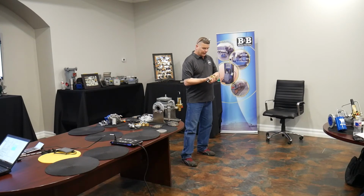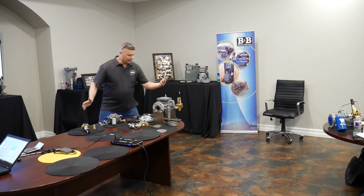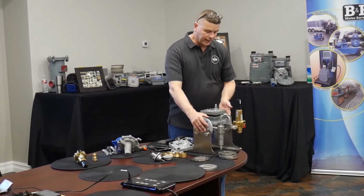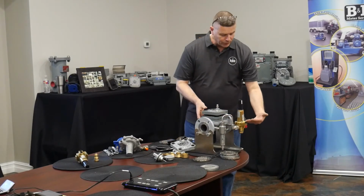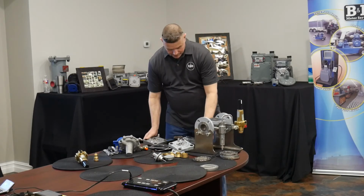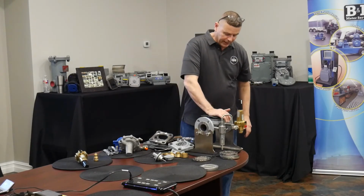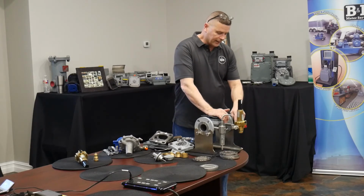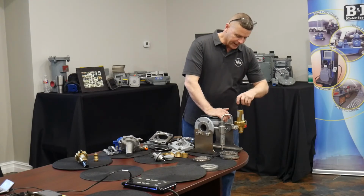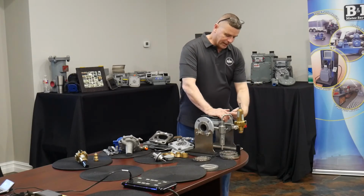Okay, so some of the things that we saw yesterday are in how this is functioning. Say 200 pounds on the inlet, cutting to 40. Gas from the inlet side comes straight through this pilot, loading on top. It is basically keeping the diaphragm tight on the throttle plate, and not until the pilot unloads the gas on top, by working against the spring tension that I put on this pilot to raise a little plug-in stem assembly, to let gas dump out the outlet.